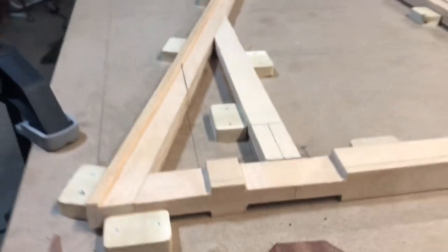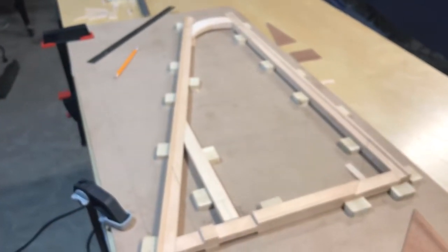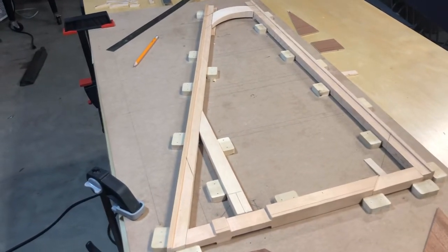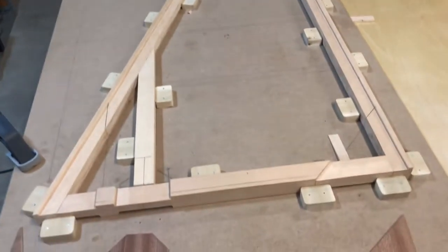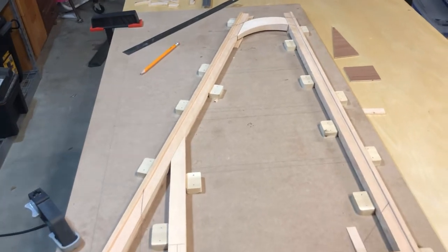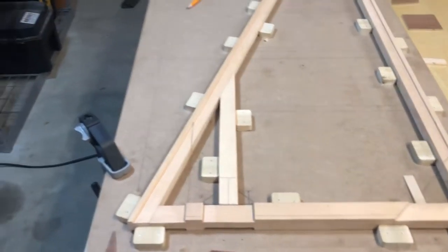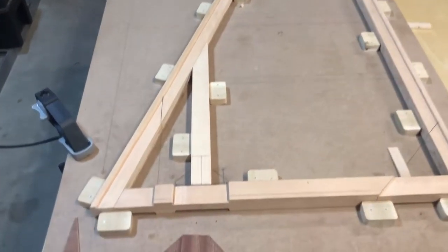The frame is about ready to be glued together. I'm going to glue mine together before I do the gussets and the ribs. I know another gentleman that did it that way and I don't see a problem with it. I just think that gluing this whole thing together with the gussets and top gussets could be pretty daunting all at once, and if things go awry you've got a lot of glue joints you just cannot back away from and fix.